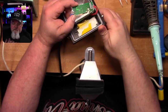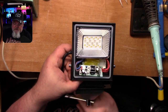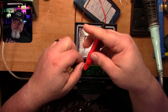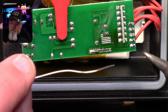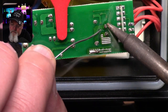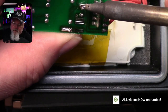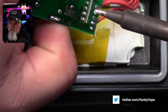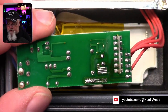It also helps to have a little vise to stabilize this on your bench — you could just tape the board to your bench if you don't have one. I like to use alligator clips from my test panel to hold the board in place. Now it's very easy for us to remove this capacitor. If you don't have soldering wick, throw some fresh solder on there. What we're going to do is heat up one contact and rock the capacitor back and forth on the other side until she falls out. Then you can use your soldering wick or solder sucker to clean out these holes.